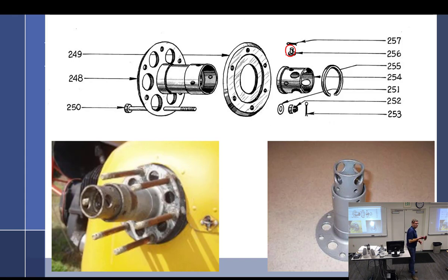So, right, there's Prussian blue, so you put a little, remember the formula is something like, you take out half of what you think you need, then take half of that, and that's twice as much as you should put in here. And so you put it in there, and then you put this on, then you pull it off, and you must have a contact area of C or better, which is 70%. So you gotta have a C.